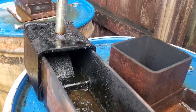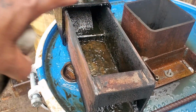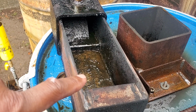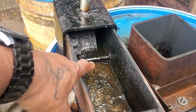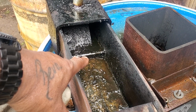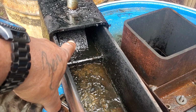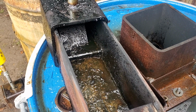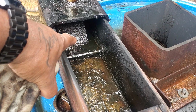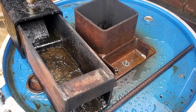First design flaw. This should have been welded across here to create a large pool area for the wicking material, which I'll get back to, and oil to collect. This ramp should not be there. What he did initially was created the pool in the back, and this plate coming down is the burn plate. These two plates get really, really hot, and the oil burns in that part of the chamber, travels forward into there, and of course up and out of the riser.